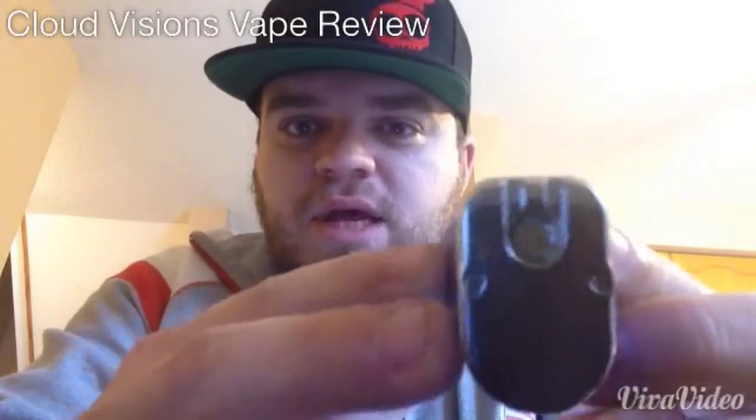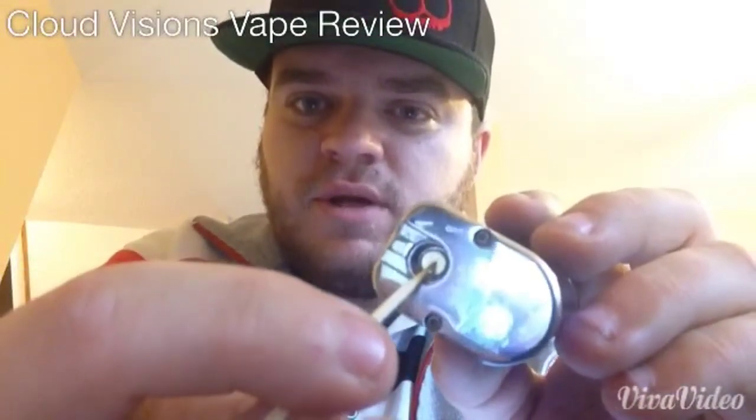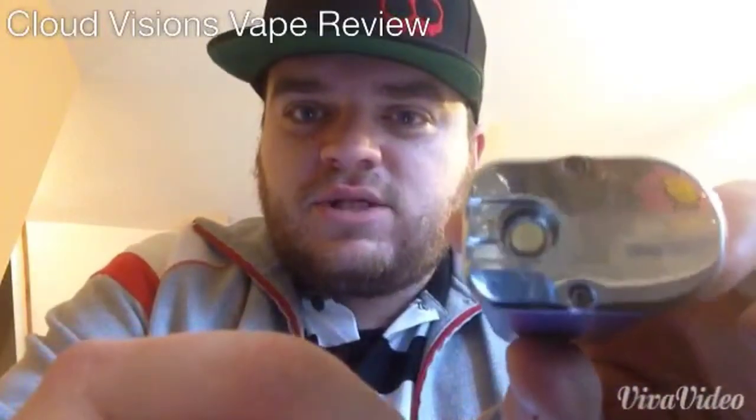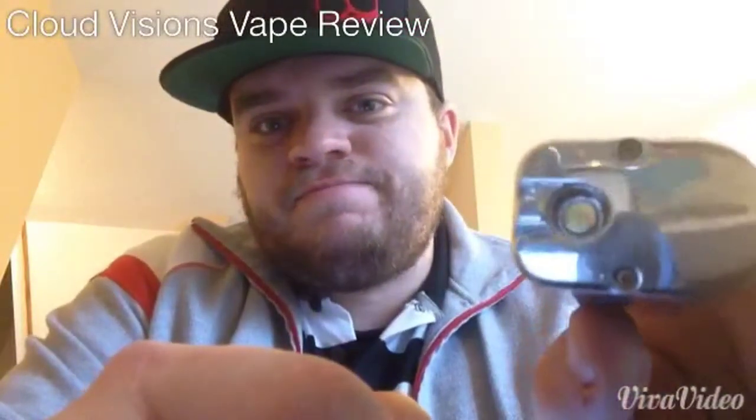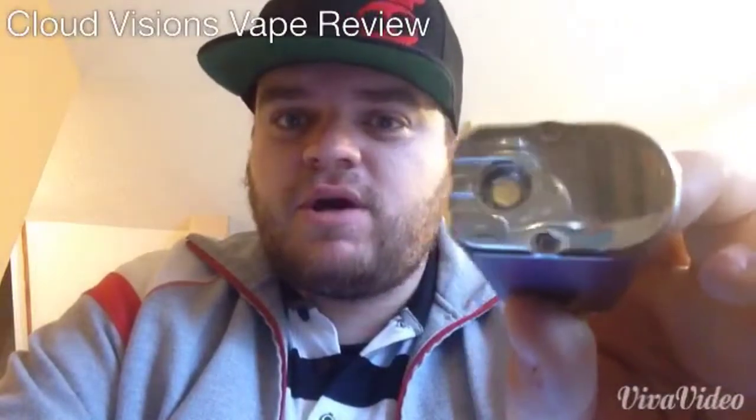And it has a 510 pin at the top. Looks like it's copper, either plated or solid copper. Doesn't look like it's adjustable. I think it might be spring loaded. So yeah, the 510 pin doesn't have a screw. It's not a screw type, so it's not adjustable. I just checked it. It does not feel like it has a spring in it. So that might be a con for some of you guys. Some of the RDAs that are not adjustable at the 510 pin might not make 100% contact on this, or you'll get ohm droppage, or your ohms jumping up and down. So that might be a little bit of a con.